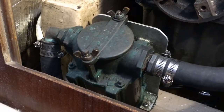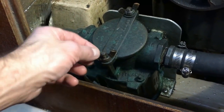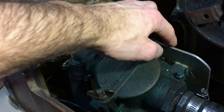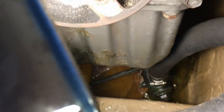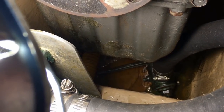It's the Perko brand strainer. I have to remove this hose and this hose. This is where I remove the filter and would drain any water once the sea cock is closed, which it is already. This is like a mounting plate, so to remove the strainer I have to unbolt it from this mounting plate. If you look down here, there's my sea cock — it's in the closed position. There's some standing water in there I'm not too happy about, so I'm going to get rid of that first.